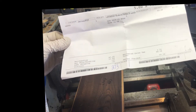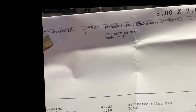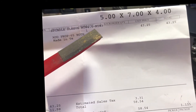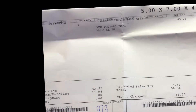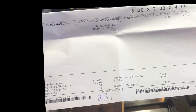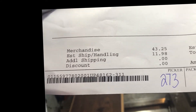I'm highlighting the part number right here — P973029 12. You can see it printed up here. It is a spindle sleeve, Morse taper 4.5 to Morse taper 3. Before anybody goes off — yes, there is a Morse taper 4.5. It's not super common but it's there, you can find it if you dig long enough. Morse taper 4.5 to Morse taper 3 — 43 bucks.